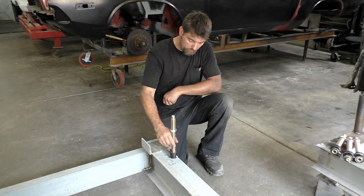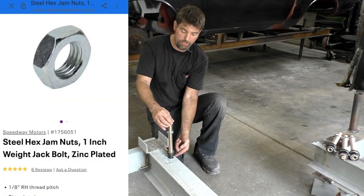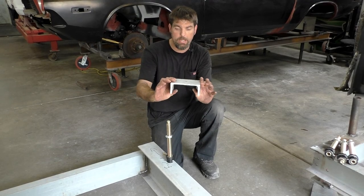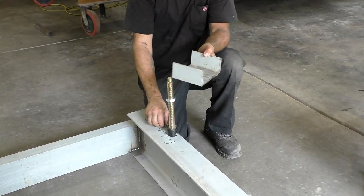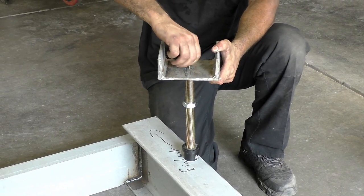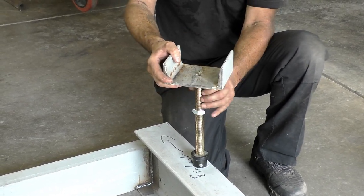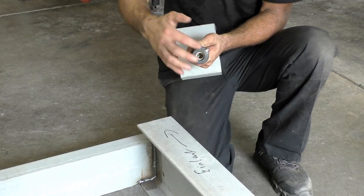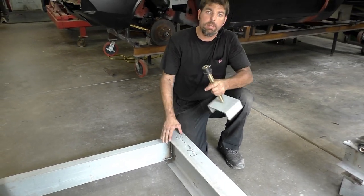This would be the bottom of it - if we want to go up 11 inches, it's going to look like that. The jam nut will be on the other side to lock it down, though the jam nut could go on either side. This is all looking upside down as this setting is going to be. We have this plate - this is going to be our leg. How the weight jack bolt works is there's going to be a bolt through here and this bolt doesn't tighten down all the way. So basically as we're screwing the screw jack, the leg can stay straight and we can actually level it just using a half-inch ratchet on the top.